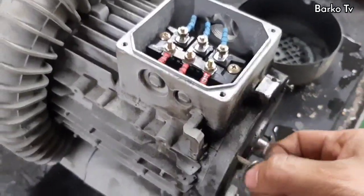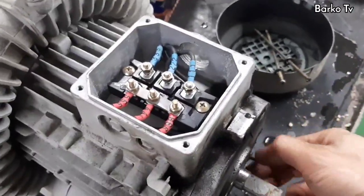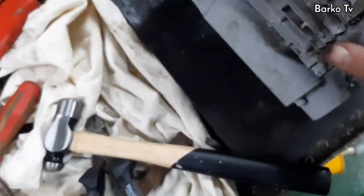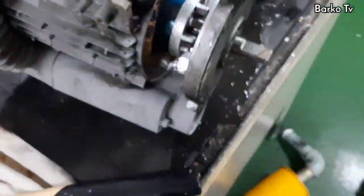The scenario is: we encountered a low insulation resistance alarm in our 440V system, then followed by a sewage system abnormal alarm. We found out that the aeration blower motor had tripped, and investigation confirmed this motor is the cause of the low insulation resistance alarm. The motor is full of water.